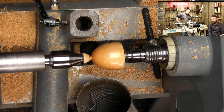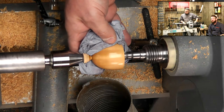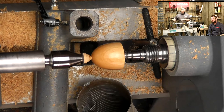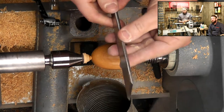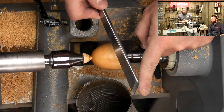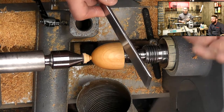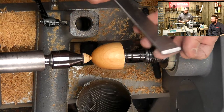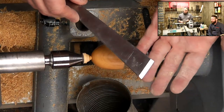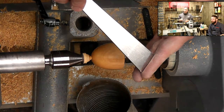Just have a go. You're only going to get good at sharpening if you practice it. In terms of skew angle on my tools, they're supposed to come with a 25 degree bevel angle, single side, so 50 degree overall angle. They don't always, because they're hand fettled at the end. They're finished by hand on a linisher. That doesn't matter, because it's as simple as if you have a finer angle, then you drop your handle down further. If it's a lesser angle, then you bring that handle up.